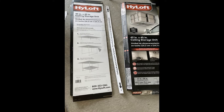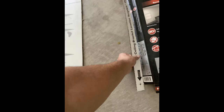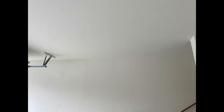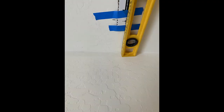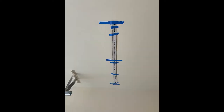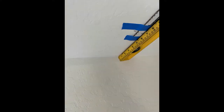Something I should have said at the beginning: when you're taking the stuff out, don't rip the box, because the box has a template showing how far apart the screws should be — that's very important. This is what I'm doing right here, just cutting out the template so I can get the measurements and figure out where I'm going to start measuring from the wall.